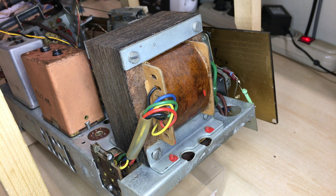In the restoration process for tube radios, one of the most important steps is to check the power supply first before powering on the radio. To determine whether the power supply is working properly, one has to be very careful — looking for shorts, looking for anything that will cause some dramatic upheaval when you switch it on. What I like to do first is a power-off test of various components, starting with the power supply and therefore starting with the power transformer.